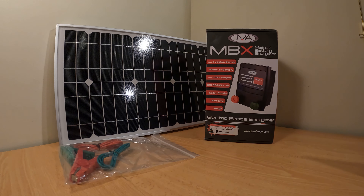In order for these units to function, you will need to source your own 12-volt battery or mains power if you wish. These are the kind of systems we would normally recommend for farmers looking to install more than three electric nets on their property. The big advantage of mains battery energizers is that you get to choose the power source, which means you have more control over the reliability of the system.